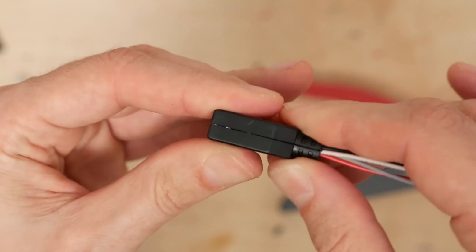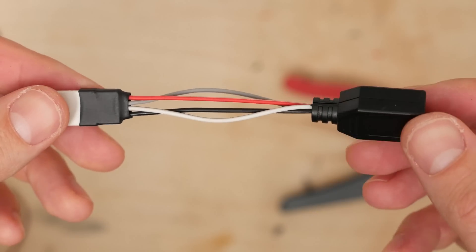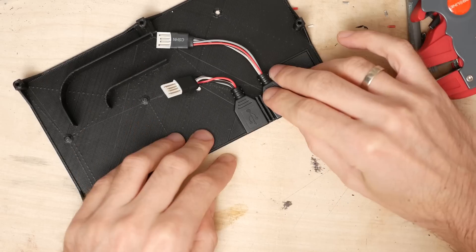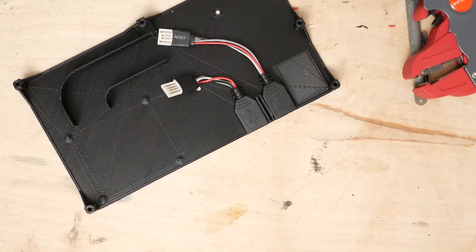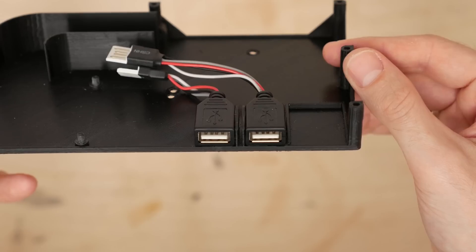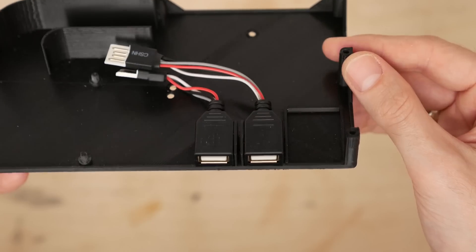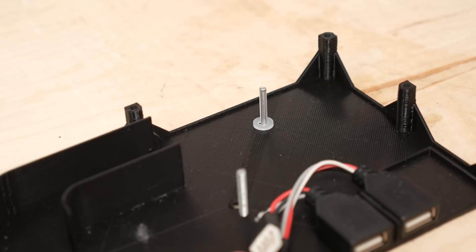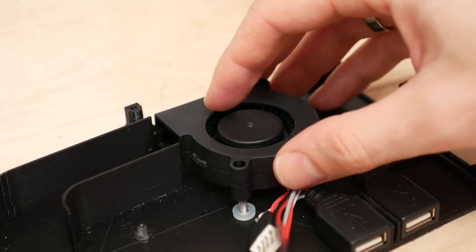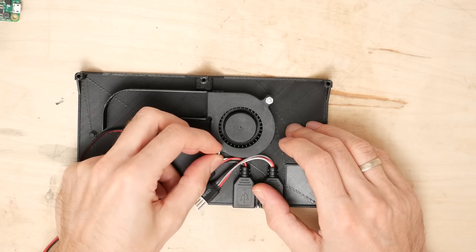I have a Pi 3 with a busted wired network that will end up in here anyway. Next I fixed the USB extensions with some glue and left it to dry. The network extension is really tight so there's no need to glue it. Installing RetroPi is very easy and I won't cover it in this video, but I have all the links in the description. I started the assembly by screwing in the fan, which requires 5 volts and I'll be powering it directly from the Pi.